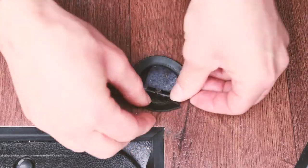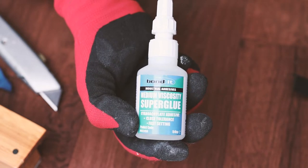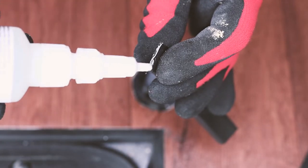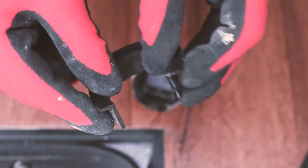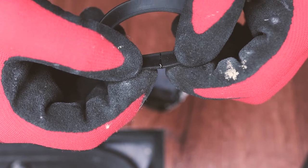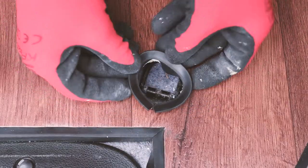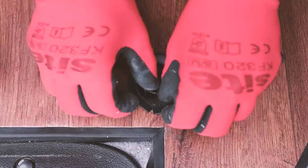I then tested the fit again in the hole and set about gluing the edges together. I used cyanoacrylate medium viscosity super glue and found it gave an incredibly strong bond to the rubber. Pressing the ends together, I had a bit of trouble getting the top edges to stick and it left a V-shape gap, so I sanded the super glue off, glued it again, and this time got a really good result.